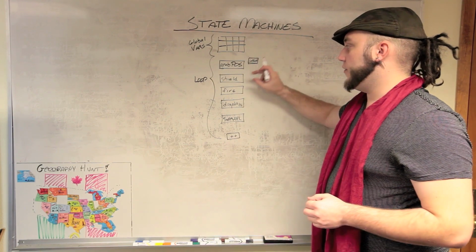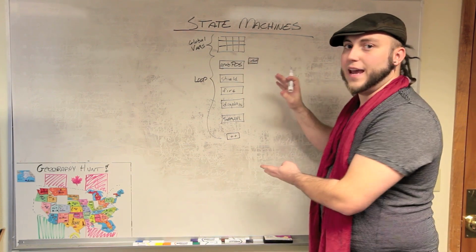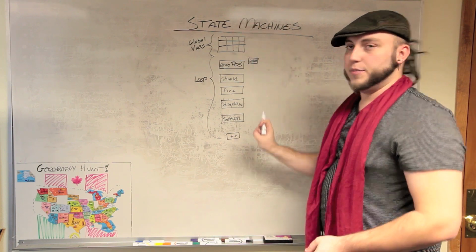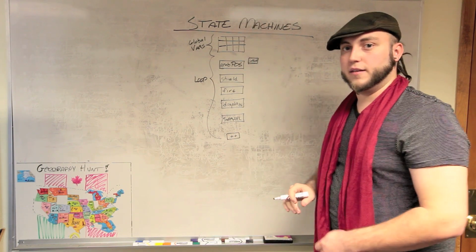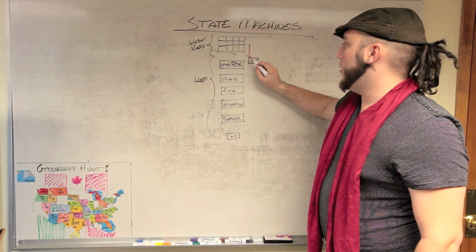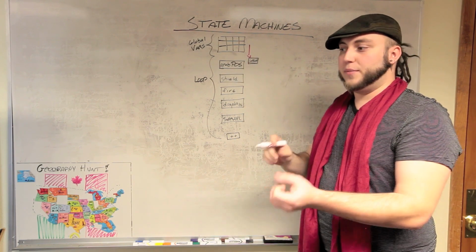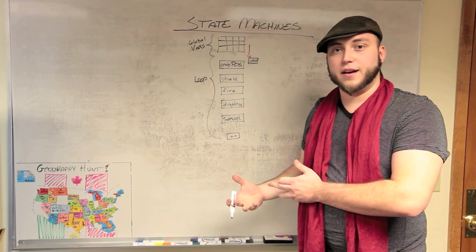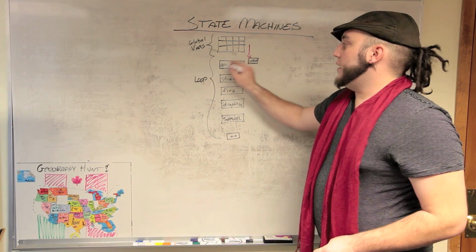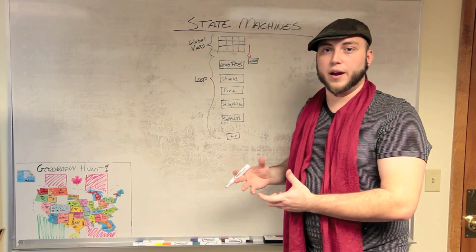So I have all these modules that sort of update things as I dump through the main loop. None of them take any arguments when you call them. They're just a thing that grabs from the global variables and then resubmits to the same global variables. When you start the program, it comes down into the first module, which is grab position. Basically it grabs the data from the accelerometer and finds out if I'm in a position that sets off a certain action. When it does a position grab, that's something that only takes one program cycle to do.